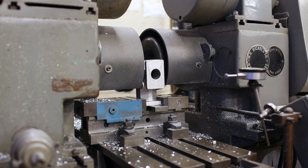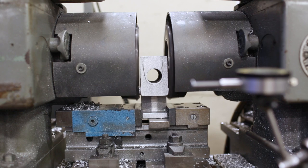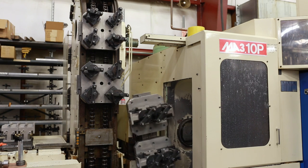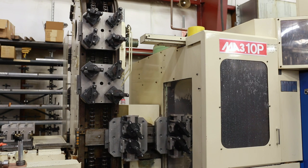The mounting surfaces on the face of the gearbox are machined to provide a flat mounting surface for the customer and for the precision machining of the remainder of the gearbox. The castings are then mounted by these surfaces onto pallets and loaded into the machining center.